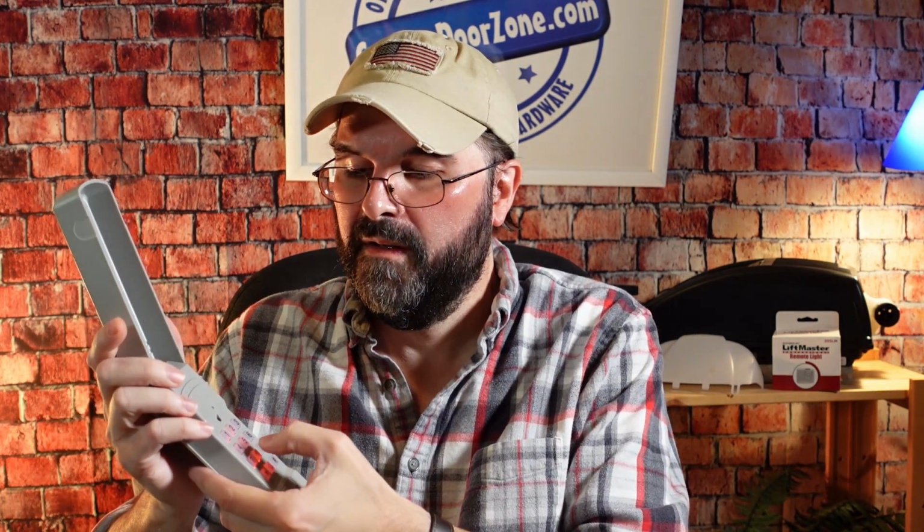So we're going to want to test that out to make sure that it took it and it's working. So to try it out, you just hit the star, 5, 6, 7, 8, and then pound, and your operator should run.